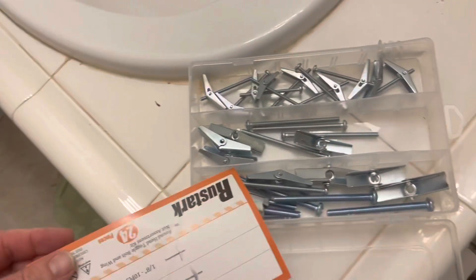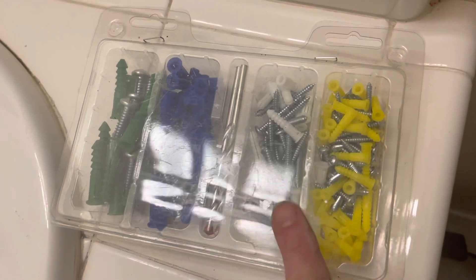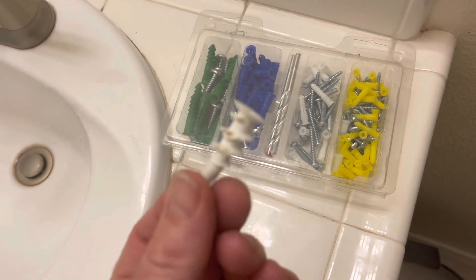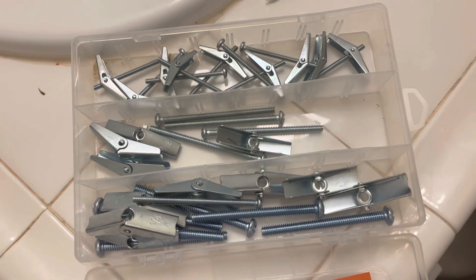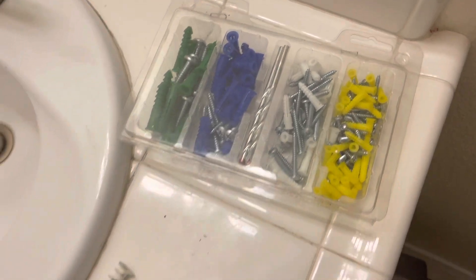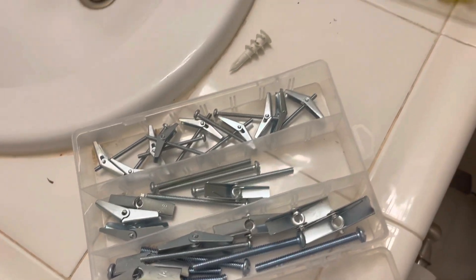You can see there are some different measurements and this is relatively inexpensive — check down in the description below. I would start with the drywall anchors that look more like this, and then if you need to, this one works really well. If these get stripped or pulled out of the wall, move up to this, and if you need it bigger than that, move up to these, depending on the size of that hole in the drywall. These are all rated for different amounts of weight too, so if you have something heavy on the wall, pay attention to that.